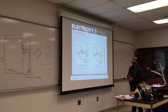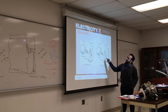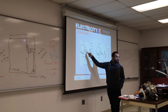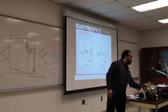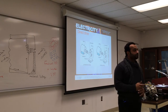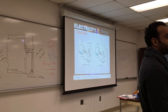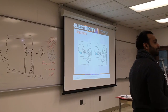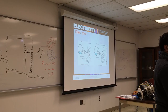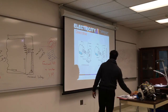Here it looks like our coupling. Big pump, and we have the same RPM, and this is again another kind of coupling. And we said we have plastic coupling in some motors. The coupling could be either solid or plastic, and the plastic is used because we want it as a safety. If something gets stuck, it should shred and disengage the motor.